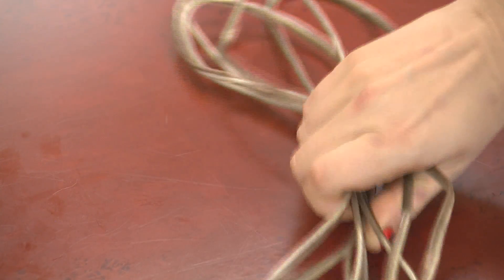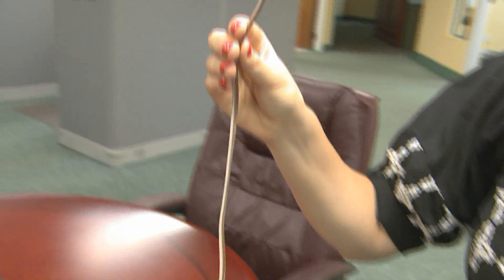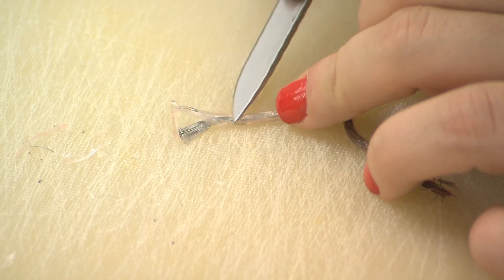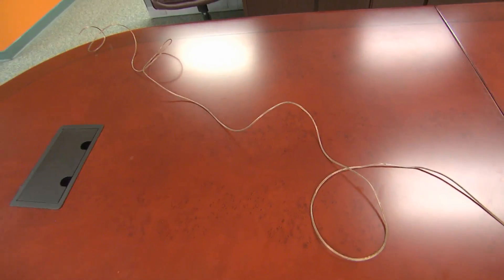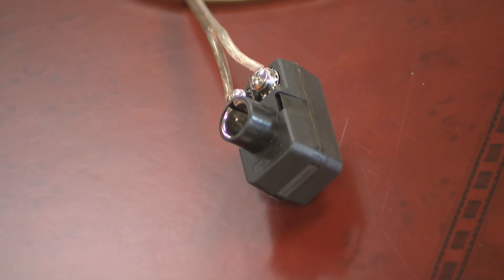So it's kind of like a recipe so far. Now that you have the supplies, it's time to actually make your antenna. Take a six-foot section of wire with the two leads still stuck together. Leave one end intact, and on the other end, peel the wires apart. Keep the last 6 to 10 inches connected on one end. On that connected side, peel the wires apart for about an inch, then strip the insulation off that one-inch section — the exact measurements don't really matter. Twist the exposed wires together and screw them under the two screws on the F-transformer. What you have now is a VHF antenna, which will bring channels 2 to 13 to your TV.